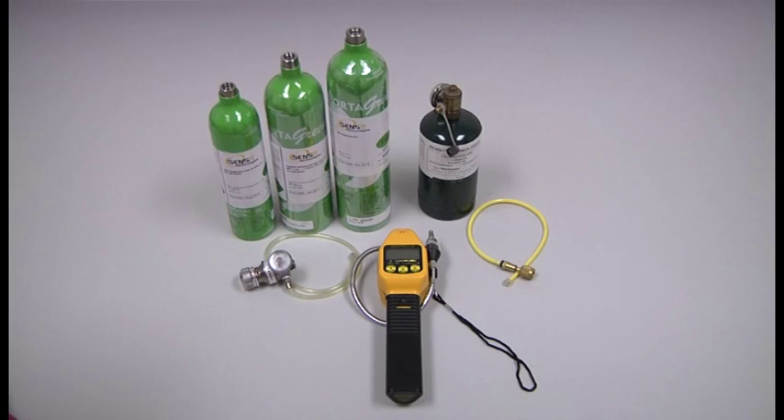Standard 4-Gas G2 Calibration gas is needed: hydrogen sulfide 25 parts per million, carbon monoxide 100 parts per million, methane 2.5% or 50% LEL, and 100% methane. For propane customers, a 1.1% calibration bottle is also required. You will need the regulator for the 1.1 and the yellow cal adapter, as well as the regulator for the hydrogen sulfide, carbon monoxide, 2.5% methane mix, 100% methane, and the Sensit Gold G2.